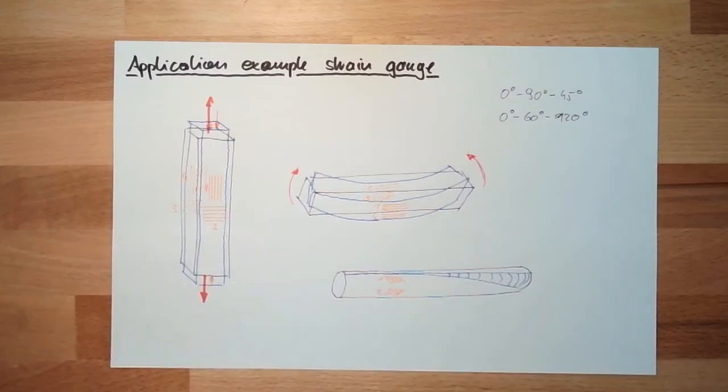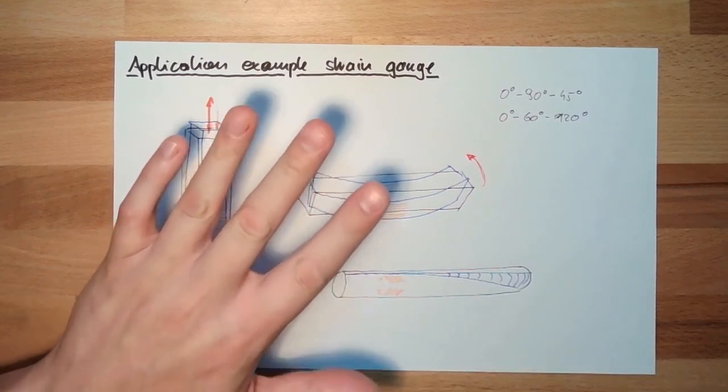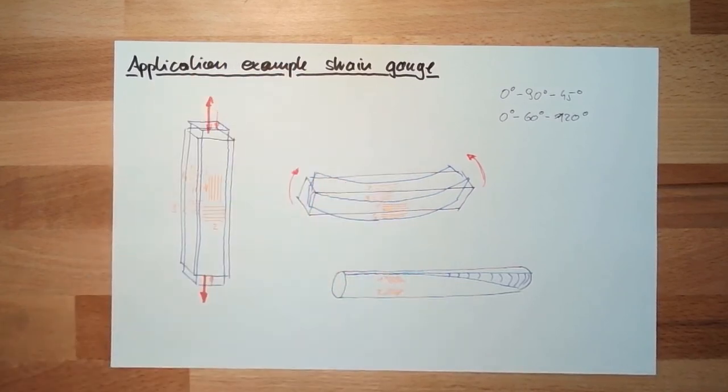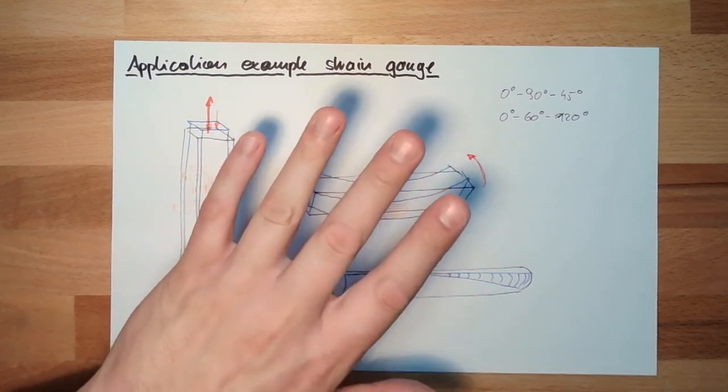However, if we know the load case, we can use the effects of the Wheatstone bridge perfectly. So we can get simply more sensitivity out of it by applying the DMS in a correct manner. Okay, that's how they help each other measuring this. I think that's about force and torque measurement. You see, this topic is not that easy, and it's also not that simple to learn and to do in reality. However, it's a very interesting field because there's a lot of physics involved.